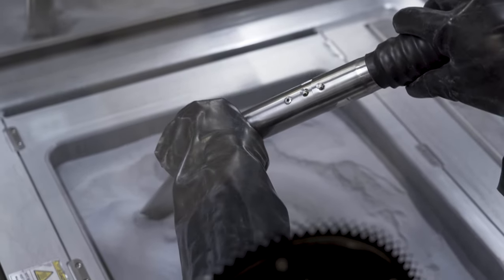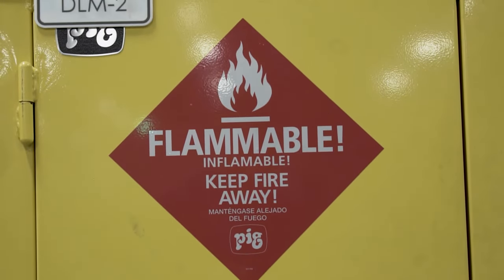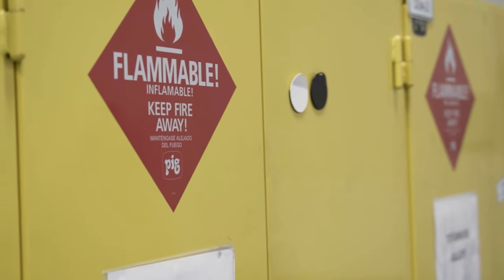The powder used in laser powder bed fusion is very fine metal powder, which calls for important handling considerations. That powder is potentially a respiratory hazard and potentially a flammability hazard. The procedures, practices, and safety equipment for dealing with these hazards are proven and well understood, practiced every day. But for a company getting into laser powder bed fusion for the first time, understanding the safety precautions and getting the right safety equipment is part of the investment — though apparently not an impediment, since this is a widely used mode of 3D printing.